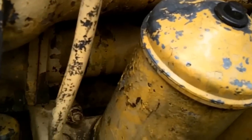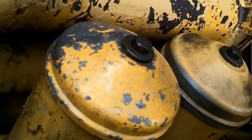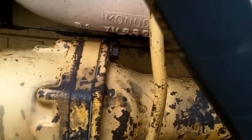And while we're at it, I'm going to take this filter base off, get rid of these old canister style filters, and change them over to a D9H spin-on filter that'll set right in here.